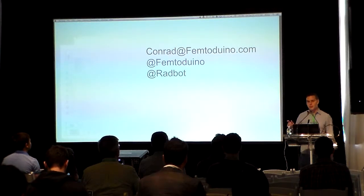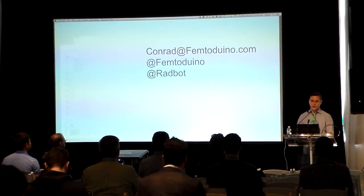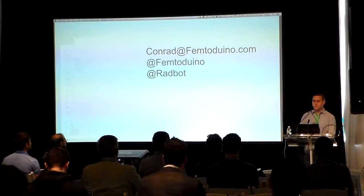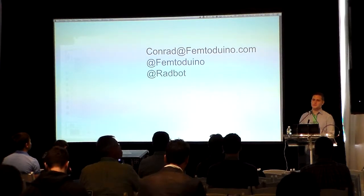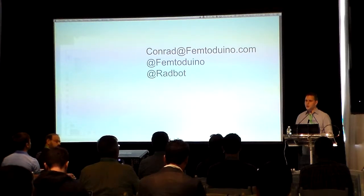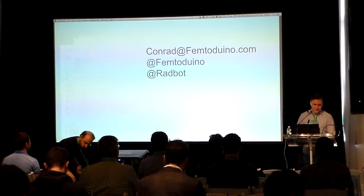smallest Arduino Uno, a really tiny thing about the size of a thumbnail, as well as a new one called the IMU Bluetooth Low Energy. Kind of a long name, but it adds inertial measurement, which is really nice. And it's the only Arduino with a barometer. So it has an accelerometer, gyroscope, and magnetometer.